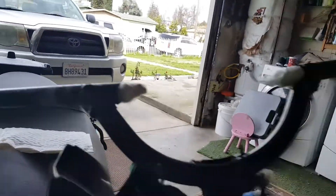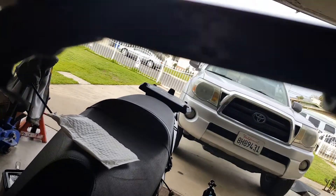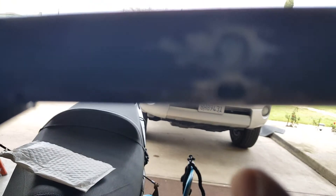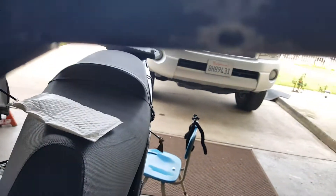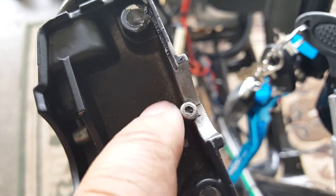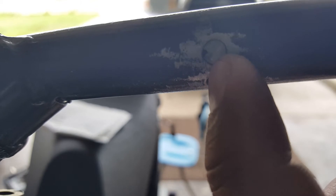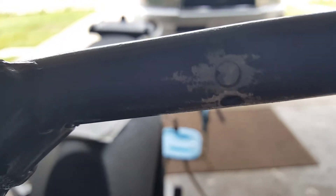We're going to patch it all up. We don't really need JB Weld to hold the hole by force — we just need to make sure that little aluminum mouth doesn't get into the other hole, so it needs to be perfectly round. We're using JB Weld as a round mold structure to make sure this tooth doesn't squeeze into another hole. Once we cover both holes up, we're going to pre-drill another one right in the middle.